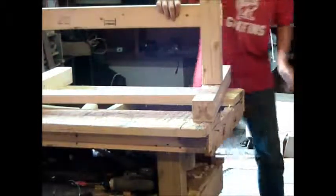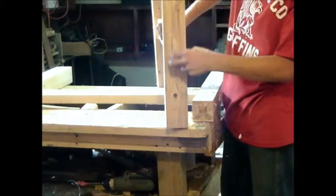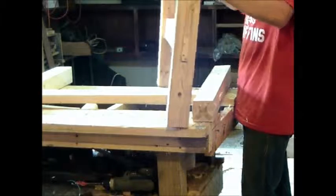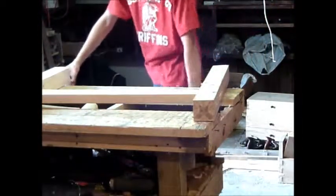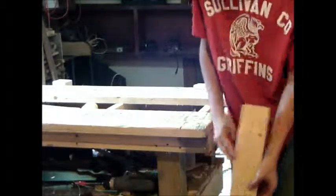All right, we'll probably get back to the workbench. I've got both of the bottom bits of the legs done — they stand up. I've cut the mortises and tenons. What we have left to do is round over these tenons because they're going to show. I'll pop one out and show you how we round them over.